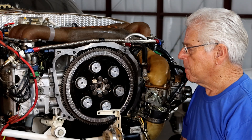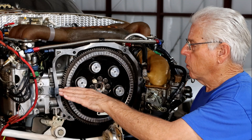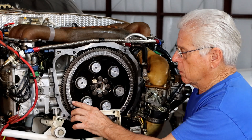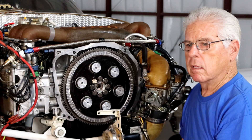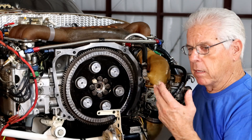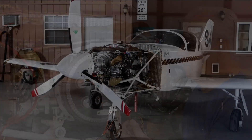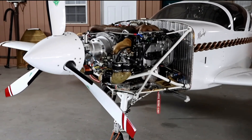The sensor measures the difference in time, telling how quickly the flywheel is speeding up or slowing down. Normally that speeding up and slowing down is a fairly slow action, but if you have torsional vibration these changes in time will be a lot larger than normal. The company can then tell me that at a particular RPM I should avoid, because that's where the problems start showing up.